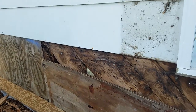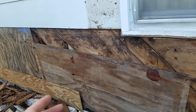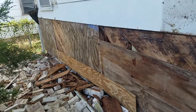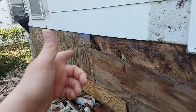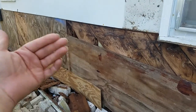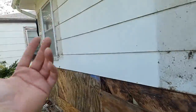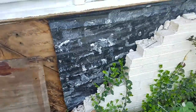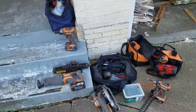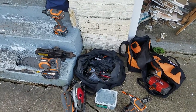I've got all this siding off and I'm just scabbing in structure where there literally was no structure. This whole corner - none of the two-by-fours were touching anything, they were floating. Next to the window, luckily one of the window studs - you could see that in the previous video - and I just took a piece of two-by-four and put it all the way down to the foundation and screwed it in so that it's holding the weight. This is the danger when you work on this type of stuff - you have to be careful.